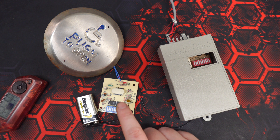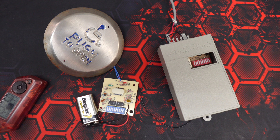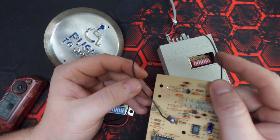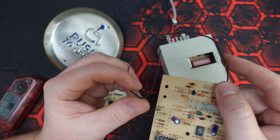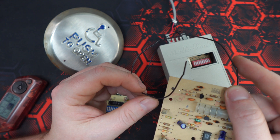The remotes for these receivers have pretty poor transmission range. The fact that the receivers are generally mounted inside of a metal enclosure of some sort doesn't help either. For example, the aluminum cases used by automatic door openers are pretty good at blocking the signal from reaching the receiver. This is usually circumvented by drilling a small hole into the case so that the antenna is able to be pulled through. In my experience, the antenna found on these Multi-Code units is always black. Being able to remember what color antenna certain door control receivers use can be quite helpful in quickly determining what brute force protocol to use.